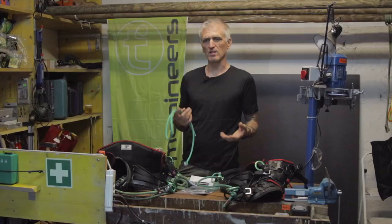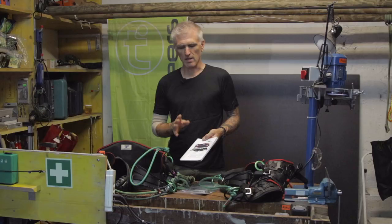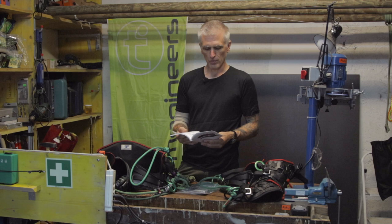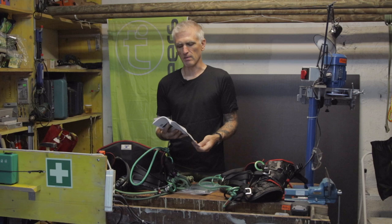There are soft factors here that are quite hard to quantify. One of the reasons we're having these questions asked of us or the manufacturer is that it's not entirely straightforward. In many ways, this is a question I would defer to the manufacturer. So let's check the user manual. On page 12, they state that if the sheath of the rope bridge is ruptured by any means — for example, cutting, heating, or abrasion — or a tactile inspection of the core identifies changes in diameter or rope properties, the rope bridge shall be replaced immediately by or under the supervision of a competent person.